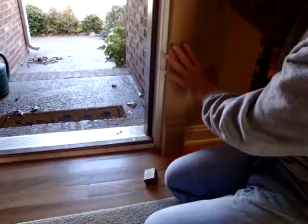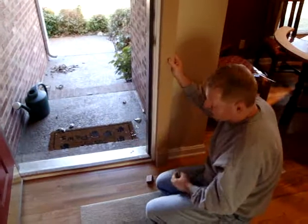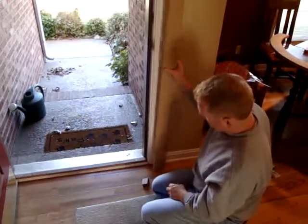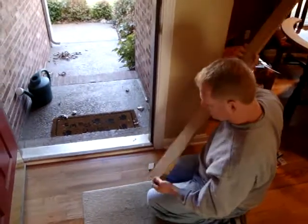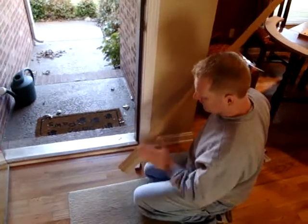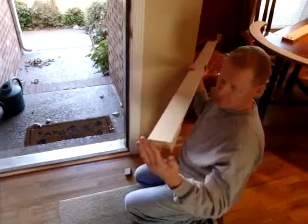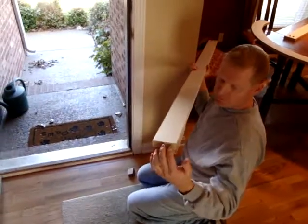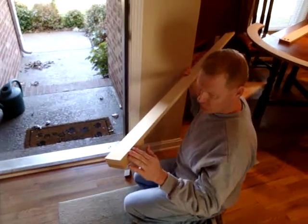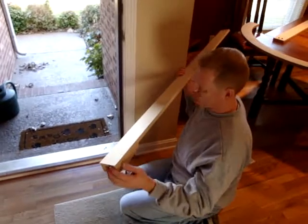Now, one other thing, this stuff is called MDF, and if it gets wet, it swells up like a sponge, which is terrible. So you have to be sure you do a good job of painting. But paint both, at least near the bottom, paint both the outside, of course, but paint the back as well. And really focus and get a lot of good paint on the bottom. This stuff on the edges soaks up paint pretty quick, so I would use a sealer on it first. Like Kilz makes a decent sealer, that's K-I-L-Z.